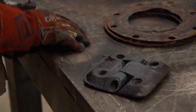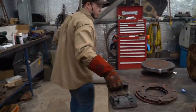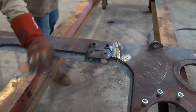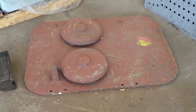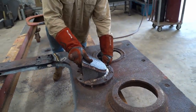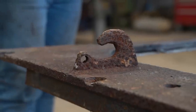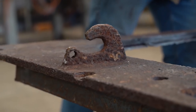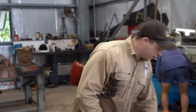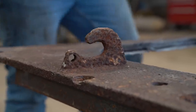There are two hinges for it and this is the cover. That'll come off — one there, one here. They bolt onto the cover, which is on the floor over there, and then this cover goes on via all these bolt hooks. We just had to heat it up and get all the rust off it to pry it up. We had a hook we had to cut off because there was only a tiny little sliver of it left. So Rob supplied us with some old original plate with some nice pitting to match the other hooks. I'll cut it with the oxy, clean it all up, drill the hole, and then simply weld it on in place.